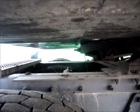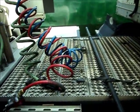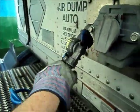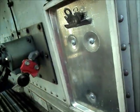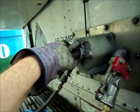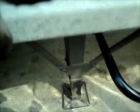Here we are in front of the trailer. You'll see that the mechanism that was sticking out is now all the way in — that tells me the jaws on the fifth wheel are locked. Now we simply reconnect the airlines and the electrical cable. We have the airlines reconnected and the electrical cable. Now all we need to do is raise the landing gear, which will be a piece of cake.